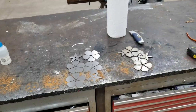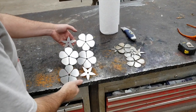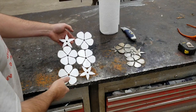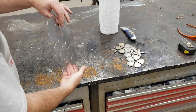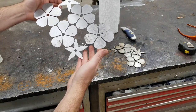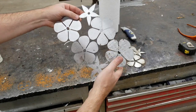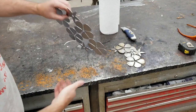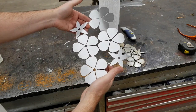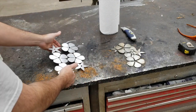Here's a quick side-by-side review of plasma versus laser on 20-gauge material. That's the front side on the laser — you can see all of our bridges are intact, and those are 60-thousandths bridges. That's the back of it. I know this sheet had a little rust on it — it was just a scrap piece I had laying around. I did run it through the belt sander, and we did use the same piece on both. By running the sheet through the belt sander and putting a grain on it, you can see right off the laser you could paint that, powder coat it, bend it, heat treat it — whatever you're ready to do.